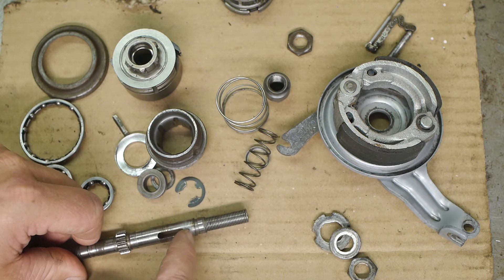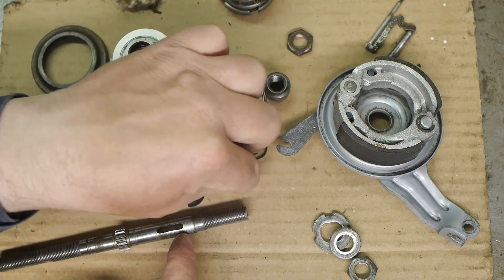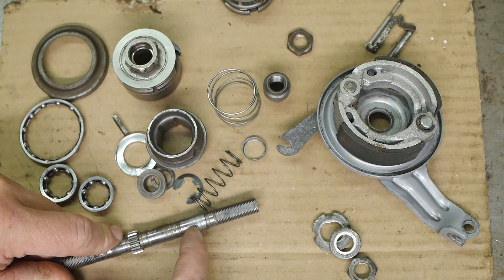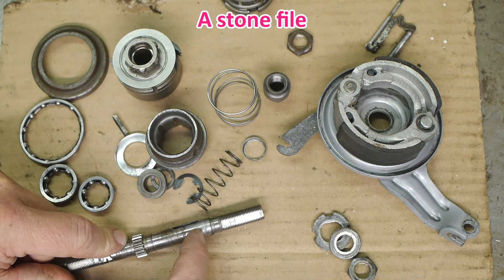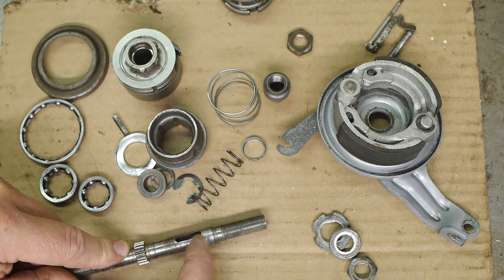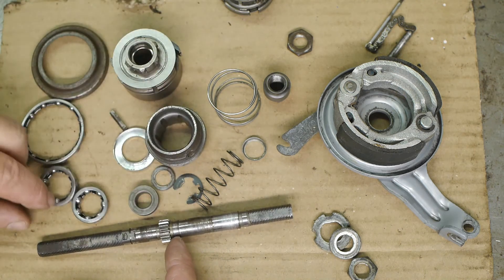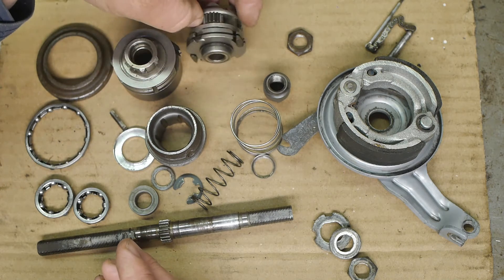It is actually significant, but since there's nothing riding on this surface except for that little cap and spring sliding over it, I'm not sure this is going to be a problem. I could stone it a little bit, put it in the lathe and use a hard file to improve the surface, but it probably doesn't matter. With no experience, it would be hard for me to make that call.